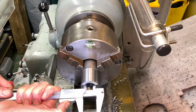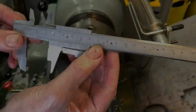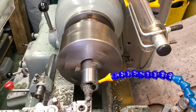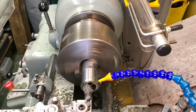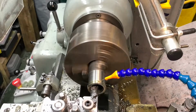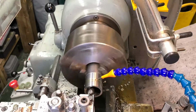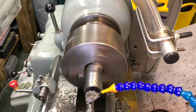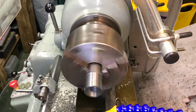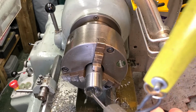Yeah, my microphone's died, but these are my Rabone Chesterman locking verniers. Great for internals, that's 1 inch and 25 thou. So about 1/4 of an inch to go. We're going to rock on some heavy cuts and then take some accurate measurements. So we're taking 100 thousandths out in even sized cuts. Take the cutter off, bring it out, bring the cutter back to where it was, knock it off, blow it out, mind your ears.